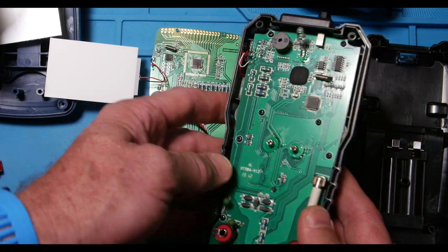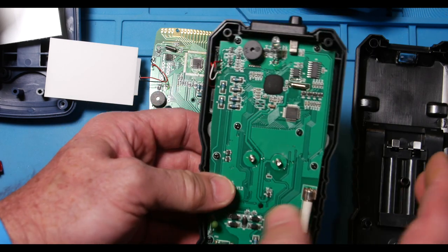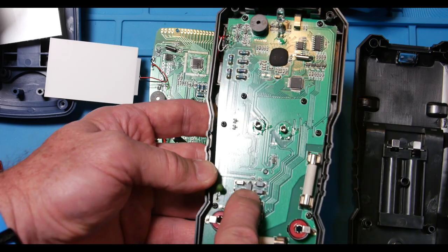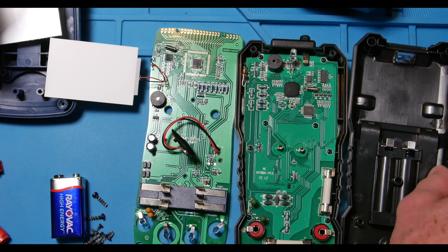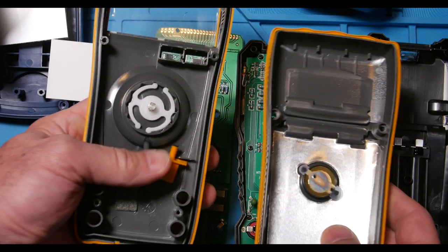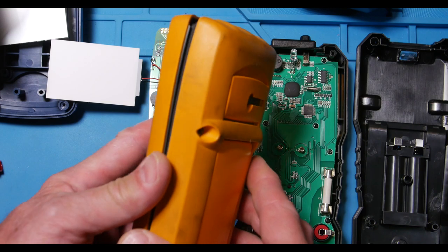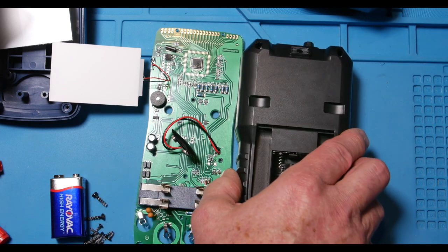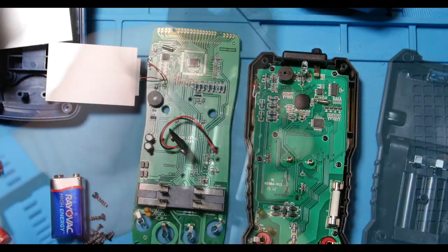I'm not going to pop off the display panel because I think the construction is very much like the Astro and I don't want springs and ball bearings popping out as a blind mate. There are 5 diodes here — the center diode could be used for protection after rectification. Also worth pointing out: the tongue and groove fit of the case — same thing on the Astro, same thing on the Fluke. They're all sealed pretty decently. The Fluke seems sealed very well; these budget meters feel fairly snug, maybe not quite as snug as the Fluke. This plastic feels pretty strong and durable.